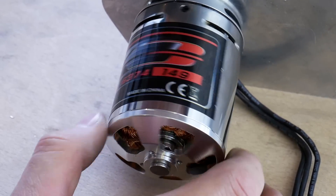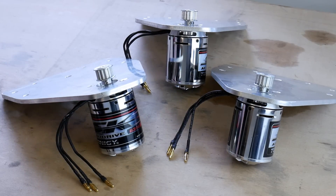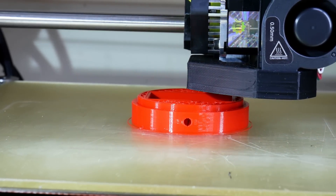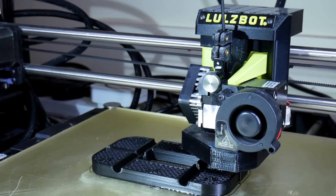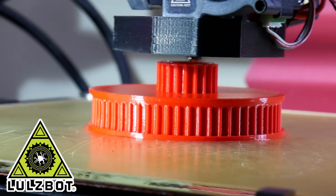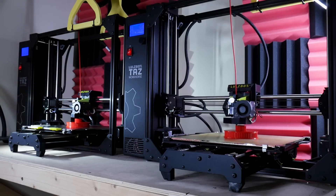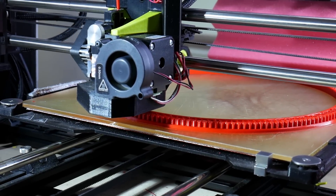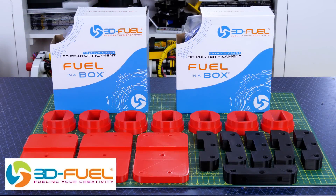I'm using the Turnigy Aero Drive 6374 149kv motors and I've made three of those to control each of the three wheels. There are quite a lot of 3D printed parts in this project — standard PLA and those parts are going to be perfectly strong enough. Thanks to Lulzbot for supporting my channel with 3D printers. The pulley we're going to print and various upper parts of the chassis use a belt reduction which in this case is going to be 3 to 1 — that's the big pulley on the wheel. Thanks to 3D Fuel for the filament for this project.